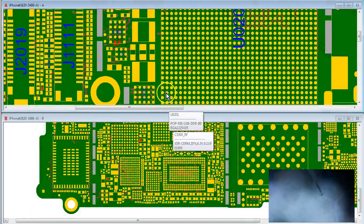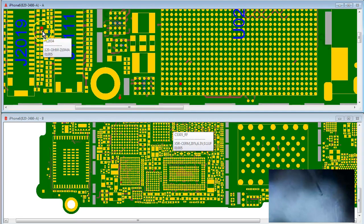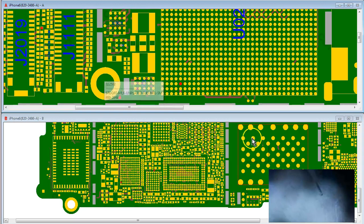So I finally went back to checking continuity. There's a test point here for the B-Sync line, and you can check for continuity between here and here. I checked and there was definitely continuity — no problems. But what was weird was that I measured diode mode one more time and I was getting 0.57, which told me we've got some issues.